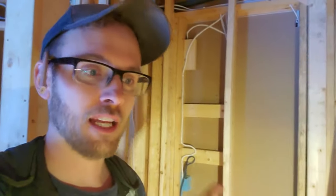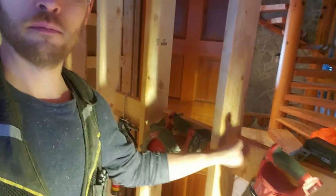It even comes down to the preference of the homeowner because a reno's not done until it's done. We're going to get this fully roughed in with lights, plumbing, everything — and before it gets boarded, we go through with the client and give them one last chance to confirm: are we absolutely sure? These are the lights you want, these are the heights you want, this is where you want the towel bar. If you're not putting blocking in for towel bars, grab bars, hooks, and toilet paper holders, and you're a drywall anchor cowboy — don't do that. Put the blocking in. If they come in and say they want the towel bar moved, or want to hang a heavy mirror on the wall, you can simply take the blocking, move the screws, and rock and roll.